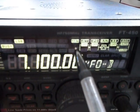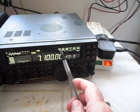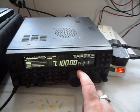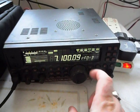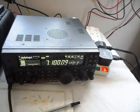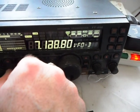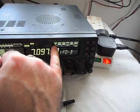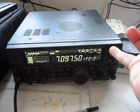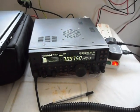There's a little icon that's flashing - it depicts an antenna immediately underneath the word 'ANT' and it's flashing. But as soon as I do anything - spin the VFO, move it fractionally - the icon stops flashing and you can transmit. I have this key set up to transmit a low power carrier, very low SWR, and basically it works as it should.